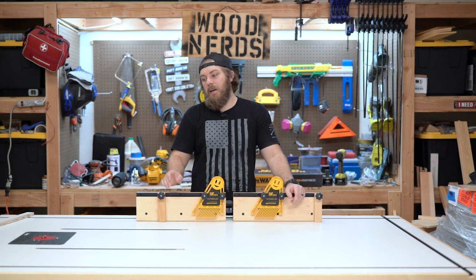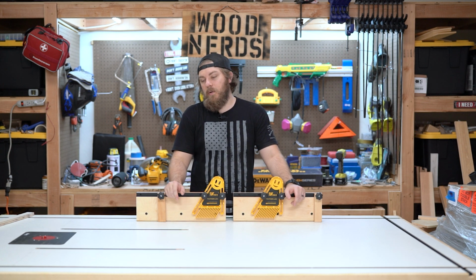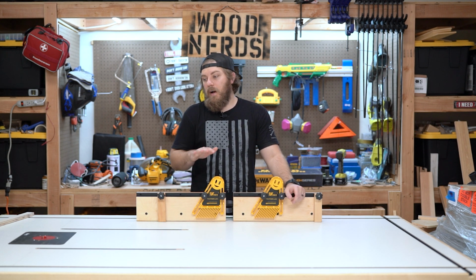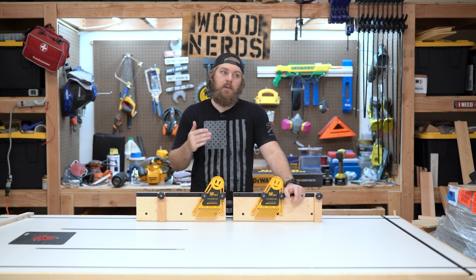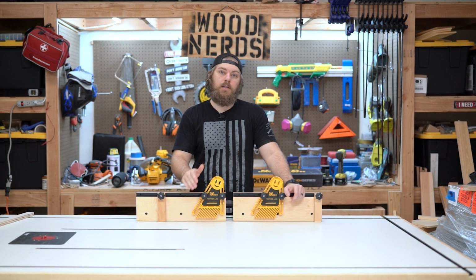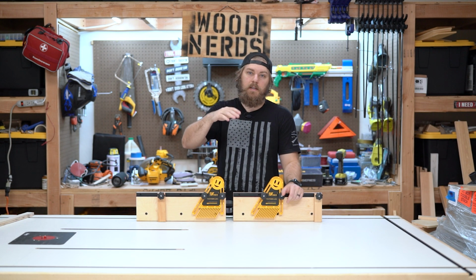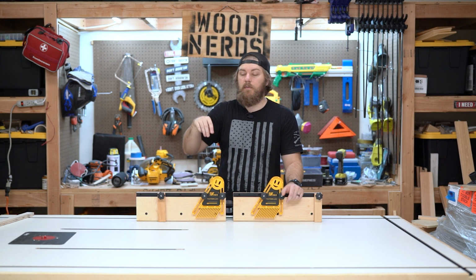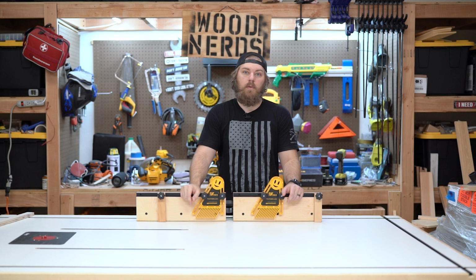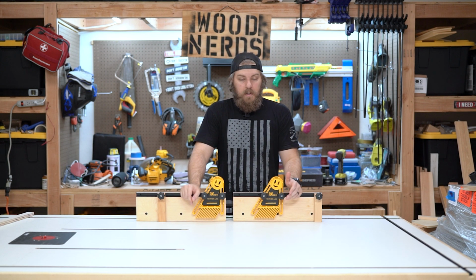That was really easy. I hope you appreciated adding the leveling steps in there. I really didn't have to. After I had routed everything, it was perfect, but I was thinking to myself, it would make sense in case it didn't work out perfect for you. You may have to do, just like I did in the second piece, go down a little bit, route out all of that extra stuff, and then add your leveling screws. But that's really it for this video.